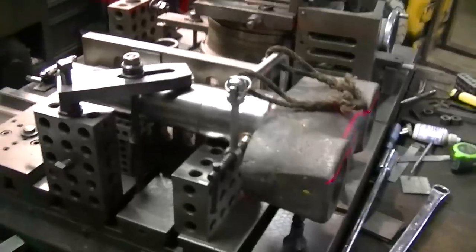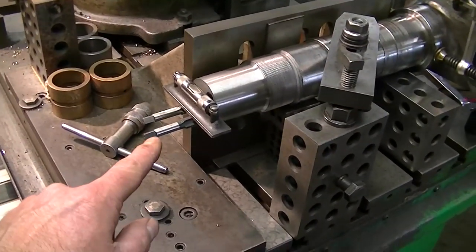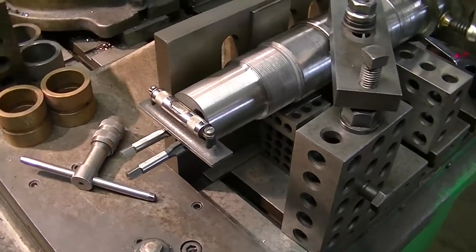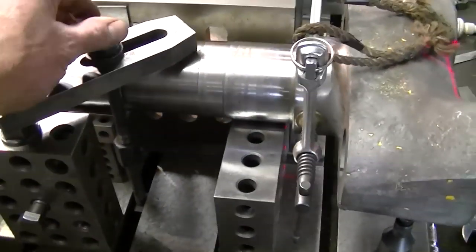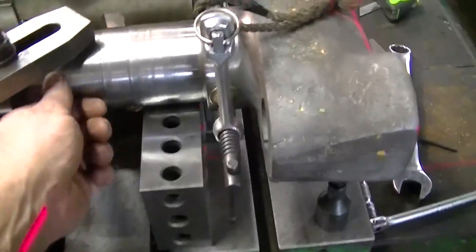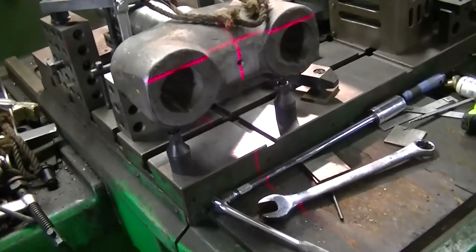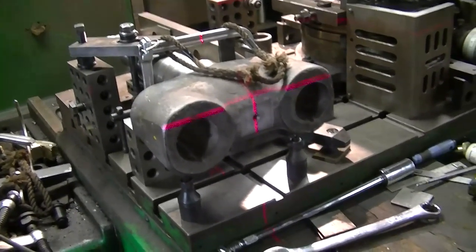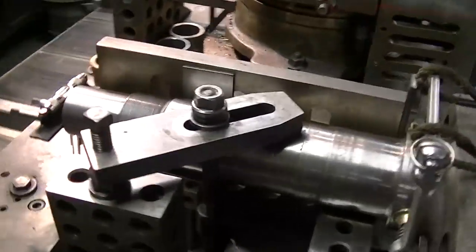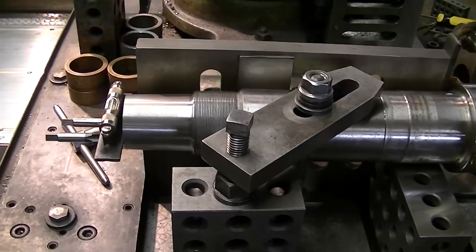All right, we're back here now. I've got a couple of 1/2-inch fine taps stuck in there, and that's a little spirit level that I use also on the milling of the key seat. This is not very tight, and it's pushed back just hand tight there. I'm just trying to make it right. Of course, I leveled it with those two little jacks, and like on the keyway cutting, I put a laser up just to see. But it matters not, because there's a cap that holds a link on that taper, and the four holes need to fit, so I've got to stay square with those holes.